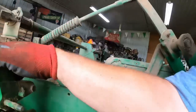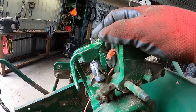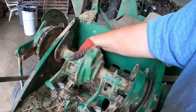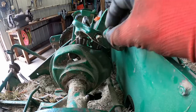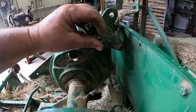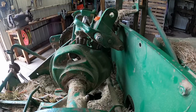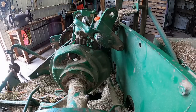Yeah, once again, we can see that I've got that to where it's just clearing the bill hook — swipe that off from there. Find another cotter pin. There's that peg you line up, spring, and the lock nut. About where it was — about three, four threads showing, it's fine threaded. Spring pressure, but not too much spring pressure. And that side should be done.